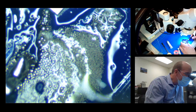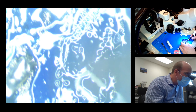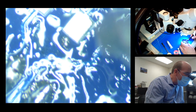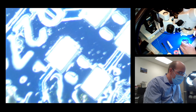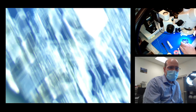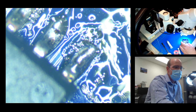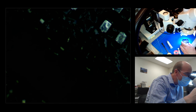What about this big old glob here? We can clean it up with the iron — kind of sweep around, grab that solder, and put it on the pin. Or we can just leave it because after we clean the board, it'll go away. Zooming out and looking at the whole chip, it looks like everything is good with no bridges.